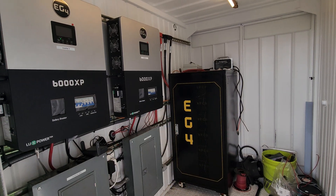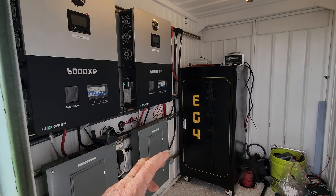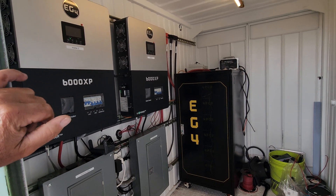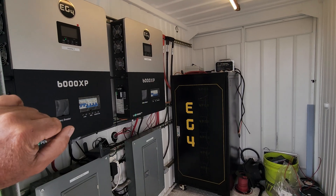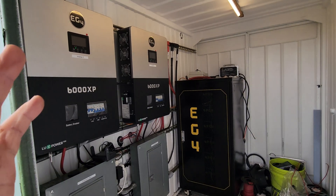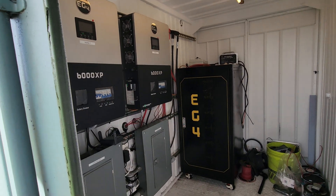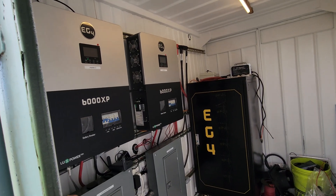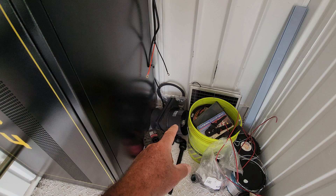This system is scalable. As you guys can see, I have two inverters and they're both on and working - everything's flawless. I'm running 240-volt AC to the off-grid home and we have another breaker panel on that home where it's dividing up the power on the circuit - L1, L2, and all that. It's powering refrigerators, full-on lights, just everything. It seems like if you came here, you would think we were connected to the grid, that's how well it's working. I will be adding another battery rack in the future and then potentially one more inverter.